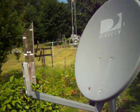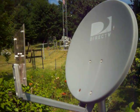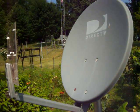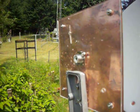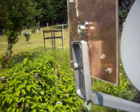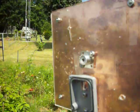This particular antenna here is an old DirecTV dish that I converted for a Wi-Fi directional antenna. As you can see, we had a 7x7 copper plate I installed. We eliminated the LNB and mounted it, and I just used a SO239 connector behind the copper plate, and you can see the mount here. And behind here, you can see the reflector.